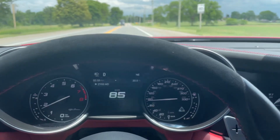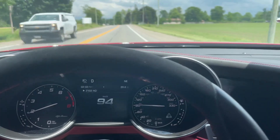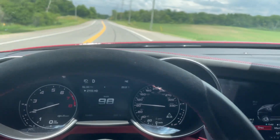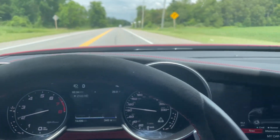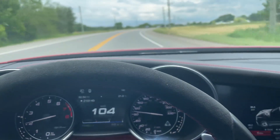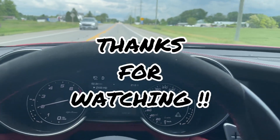After heating the brakes to well over 200 degrees Celsius, the braking still feels the same and the brake pedal doesn't get any spongier — there's no sign of brake fade. Noise levels are a bit louder when braking repeatedly, more of a growl, but no squeaking. Overall I'm pretty impressed. Let me know what you think in the comments, and don't forget to like and subscribe — we'll see you next time.